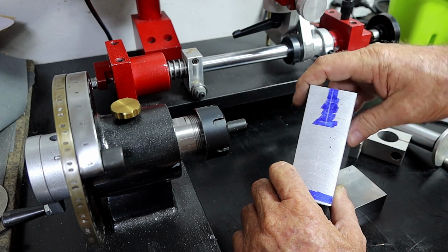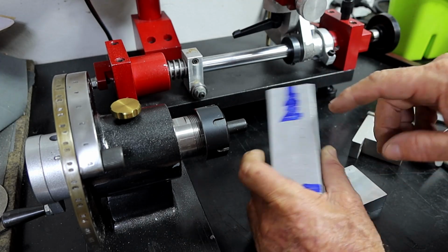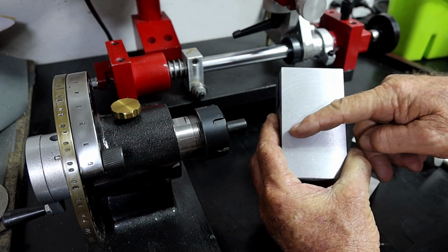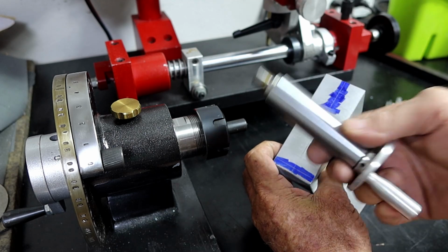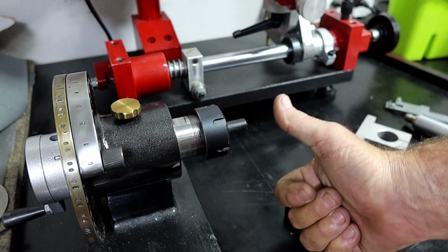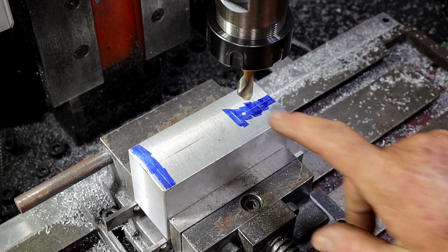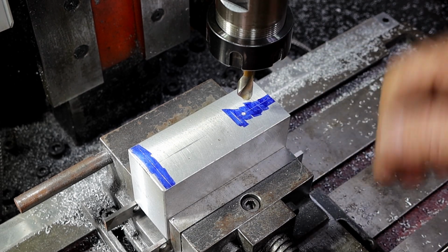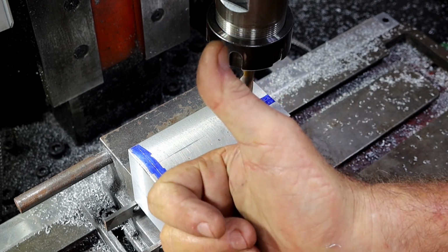So I need to do all that because I've got to bore this hole through here before I cut it in half on an angle so that I can make it adjustable. So that'll be the next cab off the rank. Get that hole bored through there to fit this thing through it. Man, how easy does that half function on DROs make it for finding centre and things. Unbelievable. Anyway, I'm not going to bore you with all the drilling side of this. When I finish drilling it out, I'll get the boring head in there and we'll bore it out.